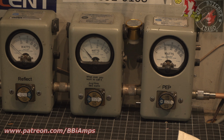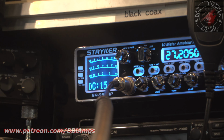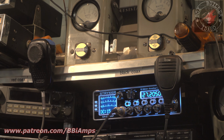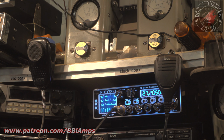Hello, 1, 1. 900 watts, right? Hello, 1, 1. 850 or whatever. Close enough. Let's go over here. Let's check our pass-through tune. Otherwise, the amp's ability to have RF pass through it and go to the dummy load. Striker likes that. Let's bring the amp into play. Dead key reflect. Nothing.